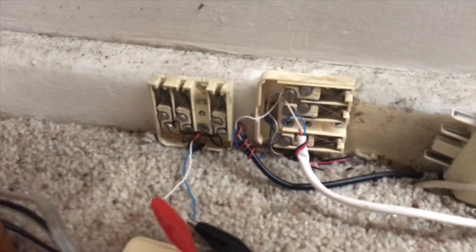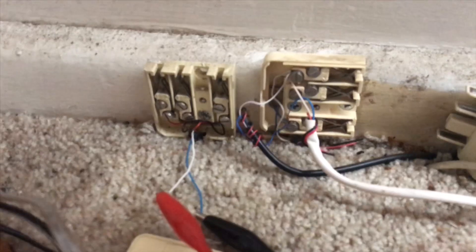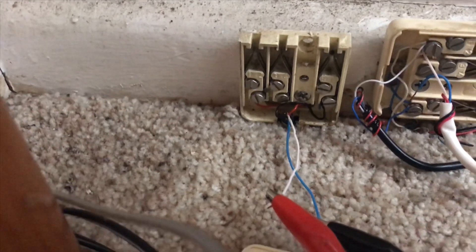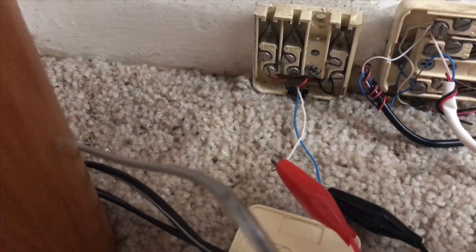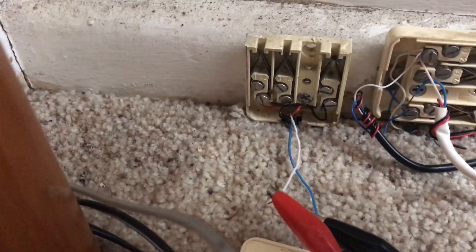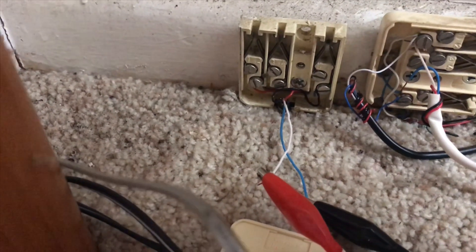The socket on the right has a thinner Optus cable that runs back to the Optus box on the side of the house. The socket on the left has a Telstra leading cable going back out to the street. The second pair — red/black — is connected to the socket, but the first pair — blue/white — isn't. The NBN data is actually coming in on the blue/white, so plugging into that socket would do nothing. The red/black goes to a junction box still connected to the Telstra copper ADSL line, while the blue/white splits off and goes into the FTTC box.